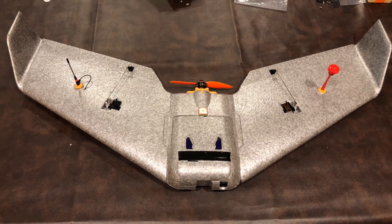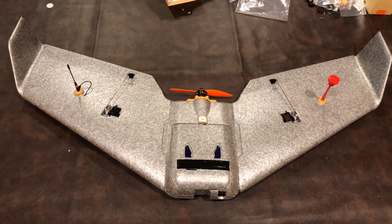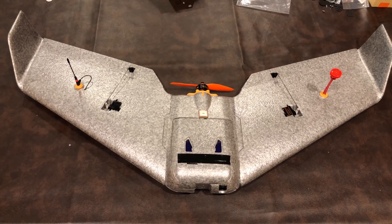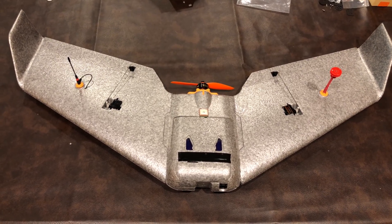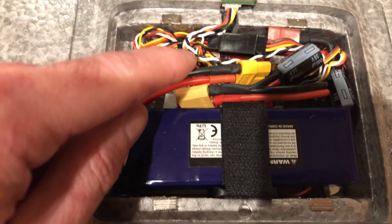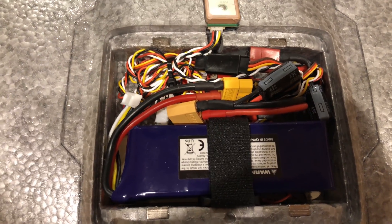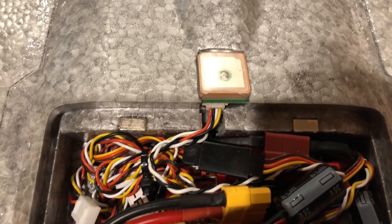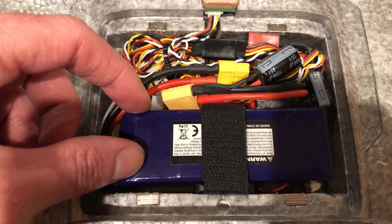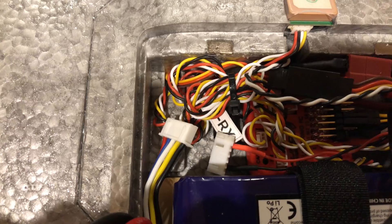These are super popular and I see why — it's like $45 for the base unit. You can also get an almost-ready-to-fly version for around $85, but I'm going to show you what I've done on this one because I tried to trick it out with prime components. Inside here there is a Furious FPV F35 flight controller, made for iNav. It comes with GPS which I've set in hollowed-out foam, and I've got a 4S 2200mAh battery.